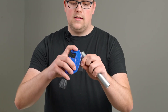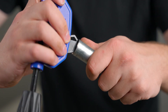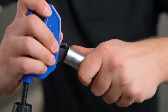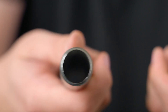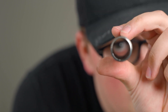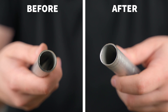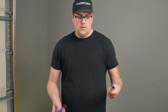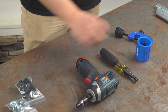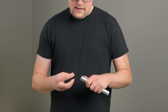All you have to do is rotate this little triangle piece out of the cutter — it has two sides that will touch the wall of the conduit. You just insert it into the conduit that you want to deburr and spin it around. After making your cut, you'll see the lip that this cutter can create. Just visually look at it as you're deburring and you'll see it become smooth with a nice edge. Definitely be careful — don't check with your finger, you might end up cutting yourself. Just visually look at it. Not only does it look good, but it also makes it easier to put accessories like an end cap into the pipe ends — it makes it a lot easier to push them in.